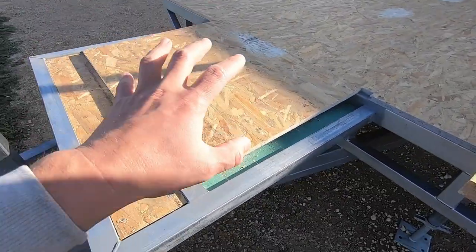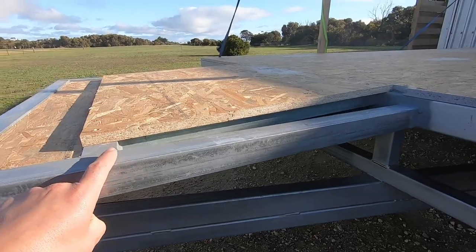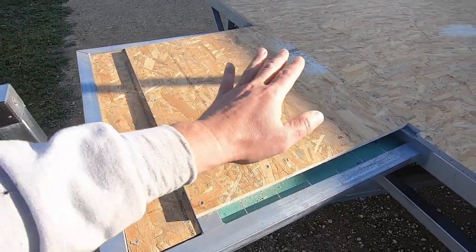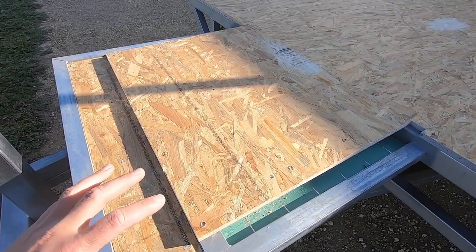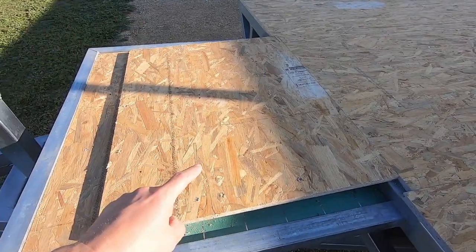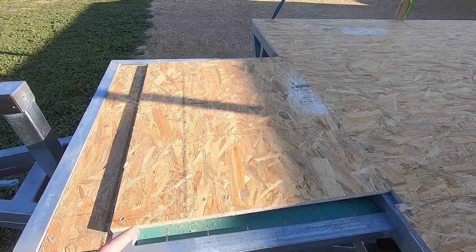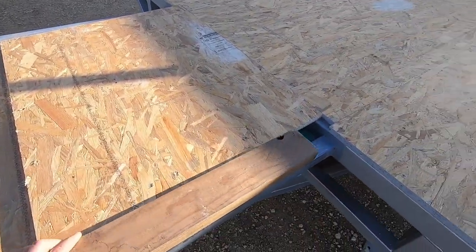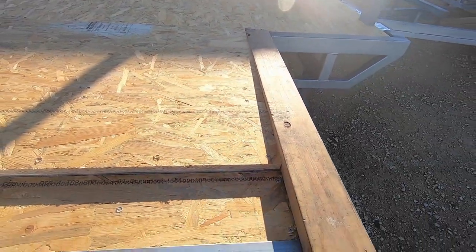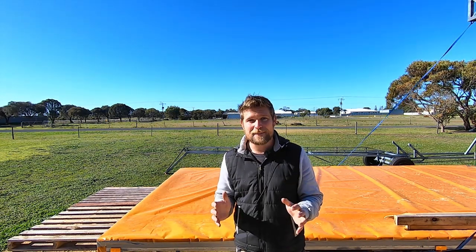The bump-out on the side trailer will house my shower. I built the shower base into the floor structure — the steel coming off the trailer has a slope in it that angles the floor down to the front, where there's a recess for a grate drain. This saves me using compounds later to create the slope and makes it much easier to deal with, especially since grate drains need quite a deep recess. OSB isn't ideal for a shower base but it has a waterproof membrane anyway, and I've been running this in the micro tiny house for over a year and a half without issues. The wall lining will come down and meet the floor here.